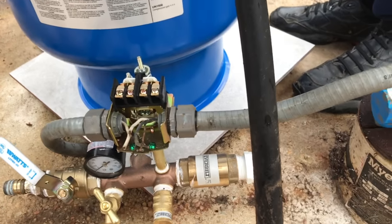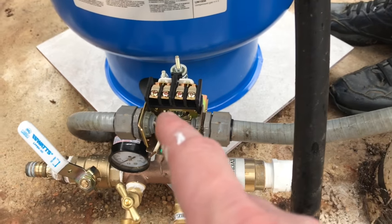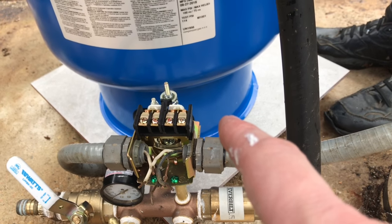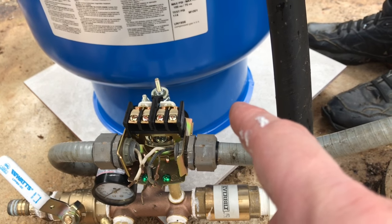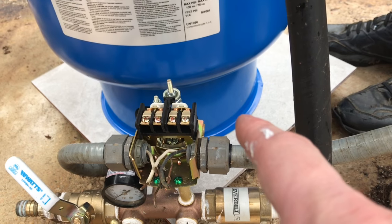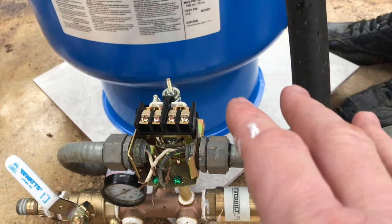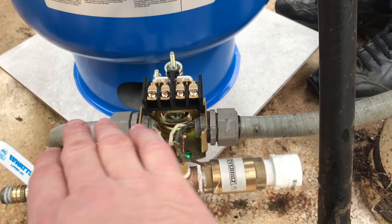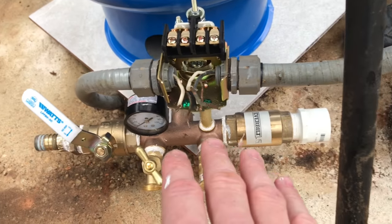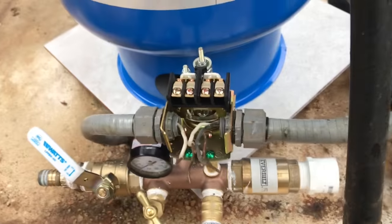Okay folks, we've got our new tank out here and it has actually started raining — I've got my son Nathaniel out here holding an umbrella over us. A couple of things we had to do: you'll notice the tank is sitting on a piece of 18-inch tile. We noticed the concrete underneath our old tank was really unlevel — it's like they poured some rough concrete and set the tank inside it. So I mixed up a little bit more concrete, leveled out a small area underneath there, laid a tile on top, made sure the tile was nice and level, and let it set up just long enough to set our tank in place. We also had to go back to the store and get a different barb fitting for our main hose. We're going to plumb this up with PVC and we'll be done here shortly.